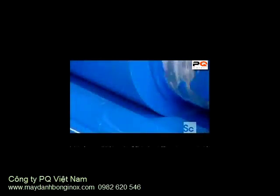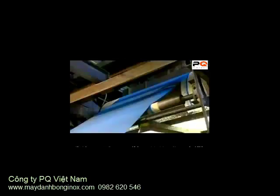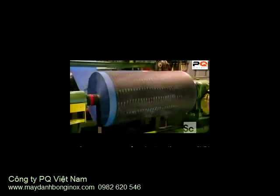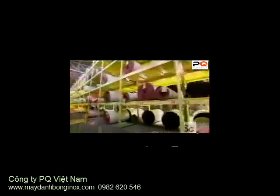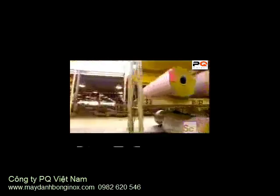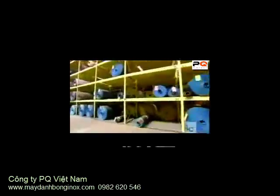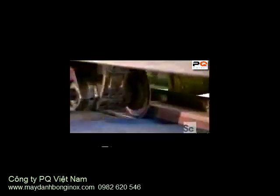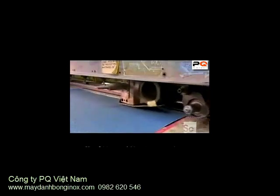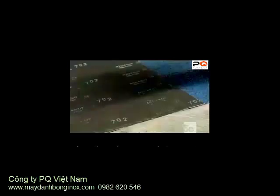In the next step, a coat of resin is rolled over the gritty surface, binding the grains to the base. After the resin is cured to the surface, these jumbo rolls of sandpaper are stored in a warehouse until it's time to cut them down to size. Some rolls are sliced into big sheets. These will be made into commercial sanding belts, the kind used in heavy manufacturing.